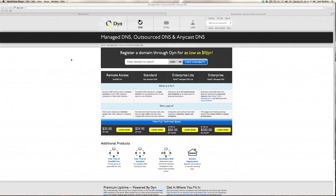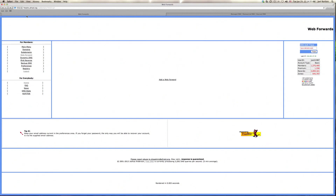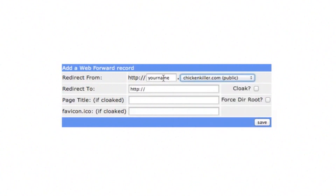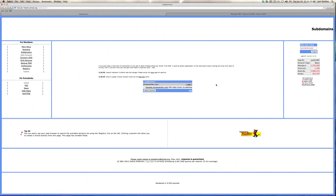Once you have configured your wireless router, the last piece of the puzzle is to set up a domain name so you can point your home IP address to a domain name for much easier access. The service I use is dynamic DNS at dyn.com, but unfortunately they have gotten rid of their free option and you now have to pay. If you have many devices to redirect it is well worth paying for, however there are other alternatives — one such alternative is freedns.afraid.org. Once you've signed up, it's as simple as clicking web forward and adding a new web forwarding service. You can redirect to your IP address — if you don't know it, go to whatismyip.com. Remember this must be your home IP address, not the IP address of the Wi-Fly server itself. Once set up, click save and your domain name should be linked to your Wi-Fly server.